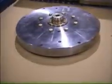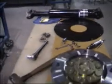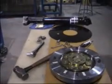Retrofitting existing product in the field would require a new coupling, a longer drive shaft, a cover plate, and a minimal amount of tools. It takes about an hour and a half to do this procedure.